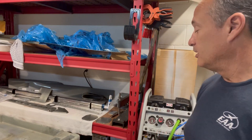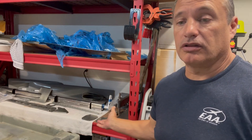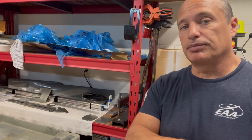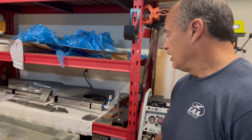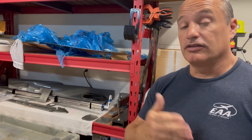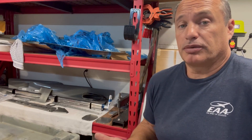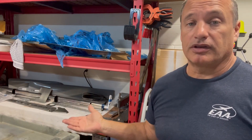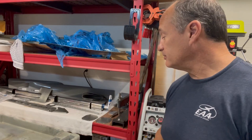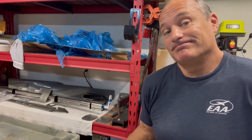The DRDT is a little bit quieter. But as far as production of results, I find all the rivets and all the dimples that I set with the C-frame to be completely consistent. I know some people say the DRDT produces a more consistent result and that's why they like it. But with this, you hit it the first time and it starts to make the dent. The second or third time there's that tone change — basically it's compressed the metal as much as it's going to compress and the dimple is set. And if you look at all the dimples, they all look the same. It's cheaper, a lot lighter, easier to store. So I went with that, and today it's going to save me trying to set this rivet. Tip!